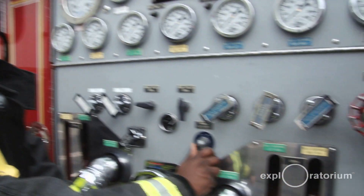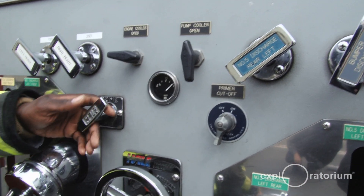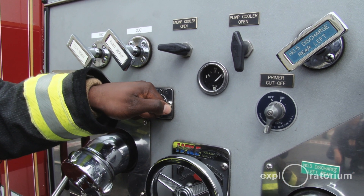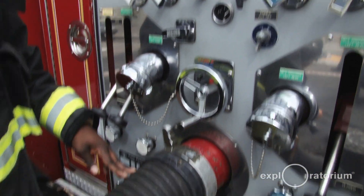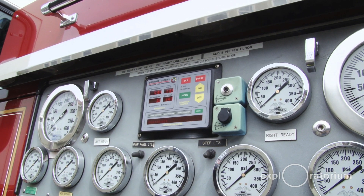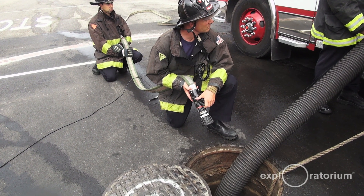To get water inside these two areas, I need to turn my primer switch to the on position. Now my primer switch has power to the auxiliary pump, and I'm going to activate my prime and do this for a period of 30 to 45 seconds. Once I notice we're getting some pressurized water coming into this hose, I'm going to dial up my throttle on the fire commander to get pressure, and then open my bumper discharge so these guys can charge the line.